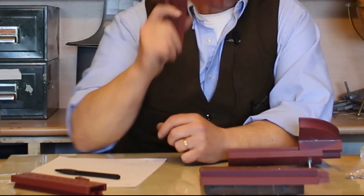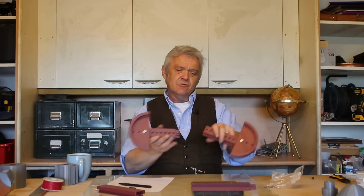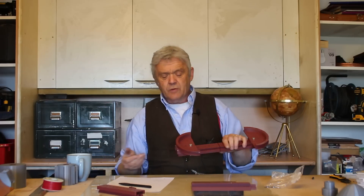The easy way is this, and it's not my invention. This is actually by a guy you may know as Grendel, and I know as Peter. Peter lives pretty close to me and when he's got a brainwave he comes around for some coffee — and he invented this. He's given me permission to put it onto Tinkercad, and I think he's put it on Thingiverse — I'll put some links in the description. This is a serpentine coil winder. It consists of two nice semi-circles so it doesn't catch the coil, and then plastic bits that stick out. We can slide these up and down to make a coil of any size we want, and I've put some M6 bolts in there to hold them in position.